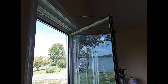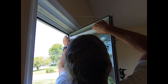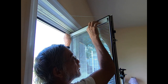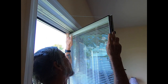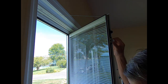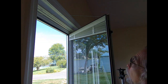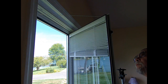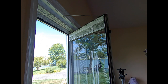Now we've got the fully assembled shade which we're going to put in place. As they say in the manual, install in the reverse order of disassembly. You want to get the end with the crank hooked in first, socketing it into the crank, and then slide the other side on. Make sure that your slider is in the right position so that you have enough travel. The first time you pull it in, suck it up tight — it'll equalize the tension on the drawstring on both sides.